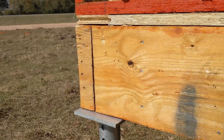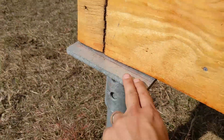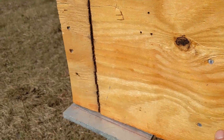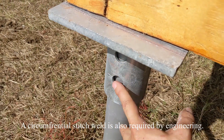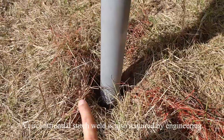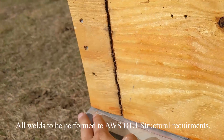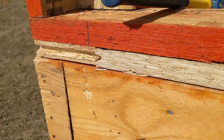I'm going to be coming back in here and adding a plate to attach this plate onto our LVL, and I'll be welding through these plug holes to get everything connected all the way down into the ground. So welds here, plate here, weld there, and bolts back into my beam.